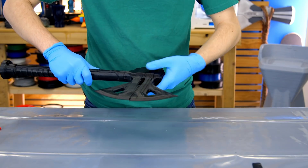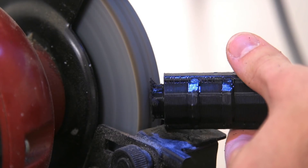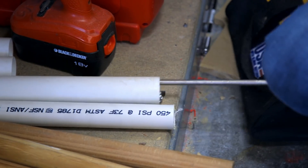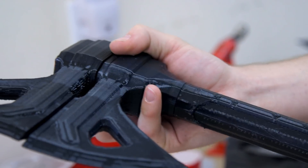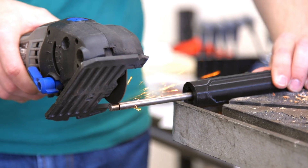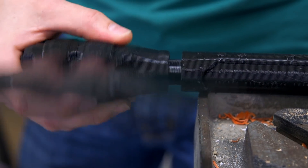The rod went in smoothly, and the pieces fit together okay, but there were some gaps. So I sanded them down using a bench grinder, whittling away at it without trying to be too careful. I grabbed another steel rod from the bin, checked the fit and saw there was still a little too much space, so I chopped it down — making sure to wear eye protection — and just a little grind and it was done. Then I reassembled it and it fits together just right.